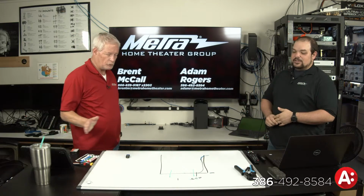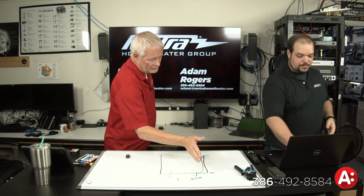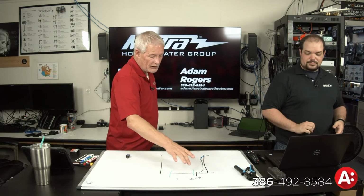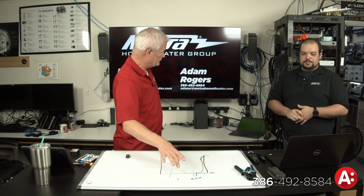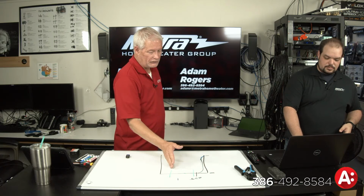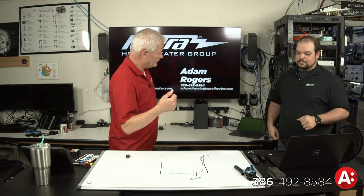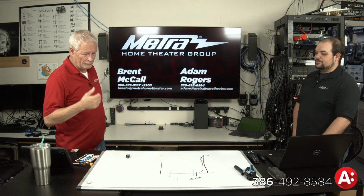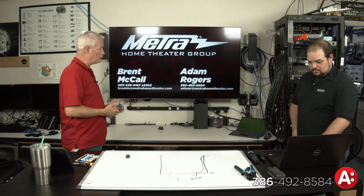Now, what you want is for the rise time to be faster than the minimum requirement. As long as you're within the requirement, it should function. But what happens is over time you will exceed that requirement, and the system fails as an indicator that you're not communicating. So that is the most common problem we see.